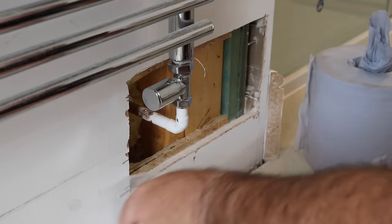I clean the ends to be soldered with some wire wool and then coat them with flux. These are Yorkshire fittings, which come with the solder already within the fitting ready to melt onto the pipe. I stop as soon as I see the silver solder flowing around the joints and it's done. I angle the pipe in my vice and put in some water just to make sure that while I'm heating the next joint, the first one doesn't re-melt. While heating, I'm also adjusting it by eye to get the joints in line and square to each other.